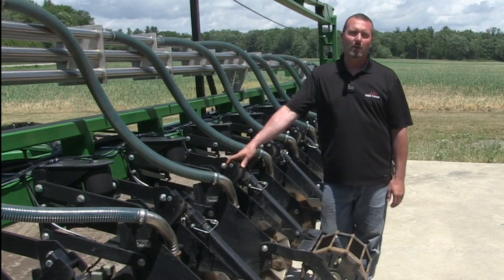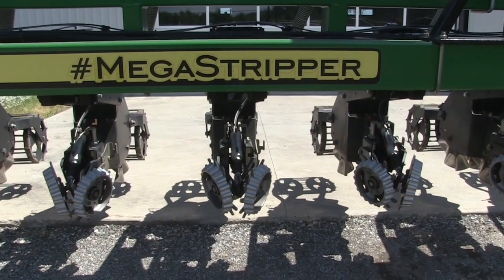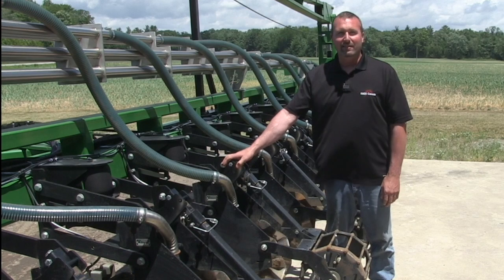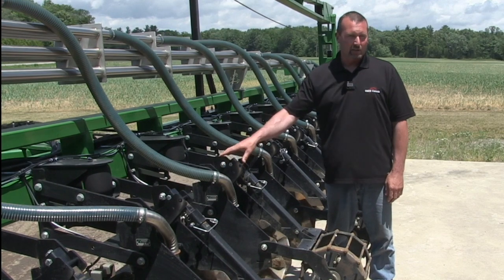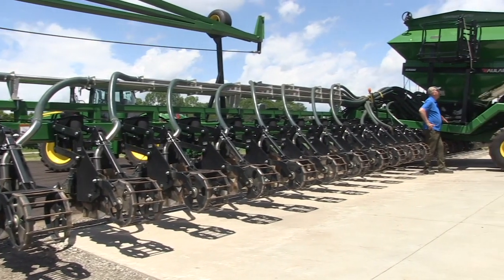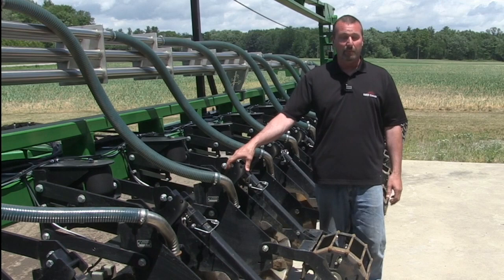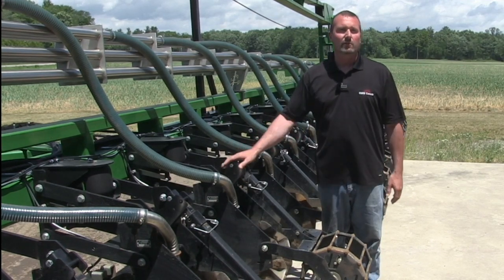The toolbar is bought, the units are brought in, but the construction and assembly of the entire thing was you and your team, right? Yeah, we have a very talented bunch of guys here at the farm. Here's the idea I wanted to do, and then we sat down — who's going to solve what. Can the Olari tank push 80 feet at the rates and speeds we wanted? And with 32 row units, would we have enough power to pull it, keeping in the 400 horsepower range?